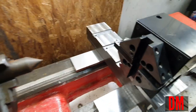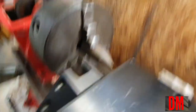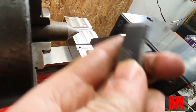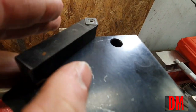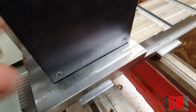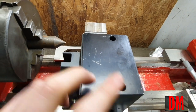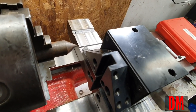Alright, so there it is. If I can do this without making too much of a mess of the camera work — that is not too far off. I can shim that quite easily and get it in the spot it should be. There's not that much play. I don't want to make a habit of this, but if I had to, I'd just mill the top of this flat so I can get more shims underneath and get it into position. Next thing I'd do for this is mill a slot for the key and make a key for this so this thing will slot in, then drill and tap. I'd have to find the bolts for this — not sure where they went. Anyway, that's all I've got for this video. Thanks for watching — I'll see you guys in the comments.